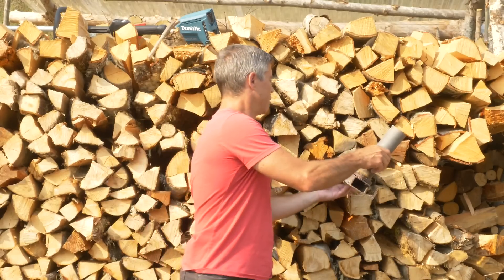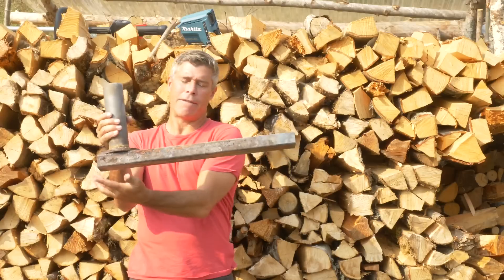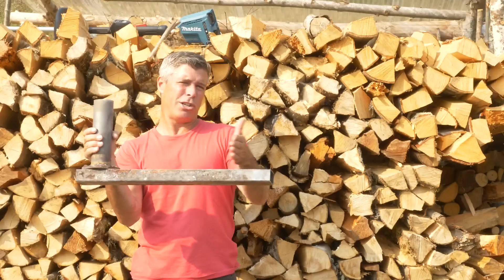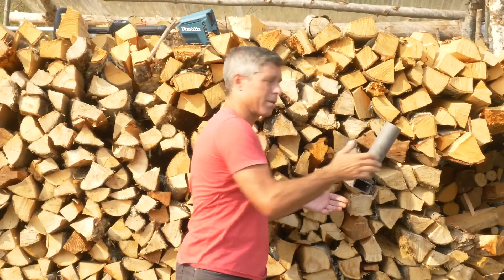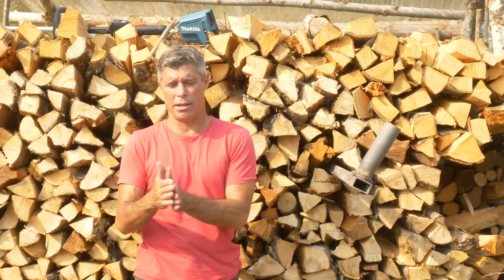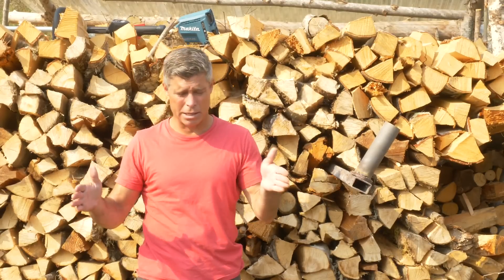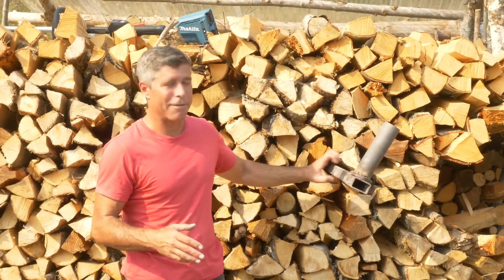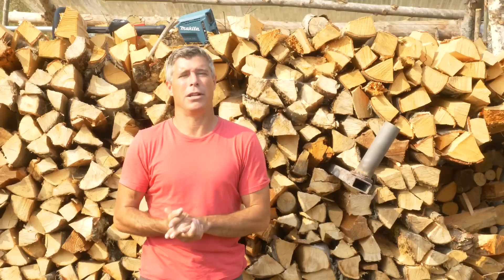I want to talk about length. If you're building the tiny cook stove or the full masonry cook stove, you'll notice I've left the length in the plans at 24 inches — the firebox isn't quite that long. That's because the door flange can be mounted anywhere on those bricks, and people have different brick sizes, so the actual width of the stove can vary by a few inches. Save inserting it until the end, put it in, and then cut it off to protrude just slightly outside into the room — but make sure it goes through the flange.